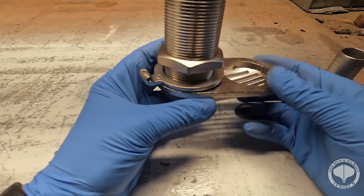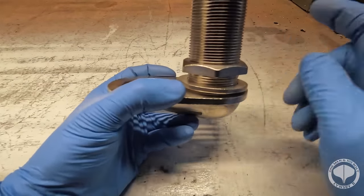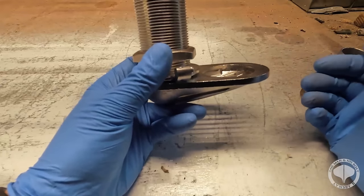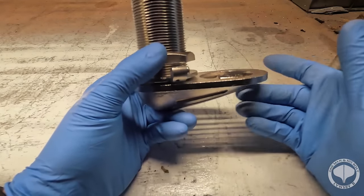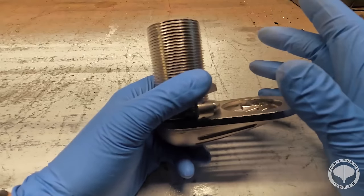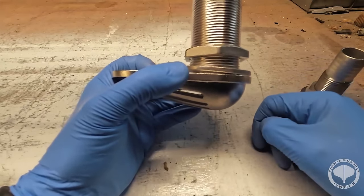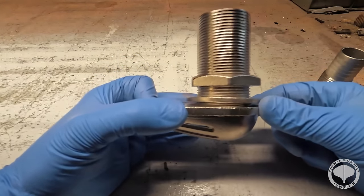Another top tip: when fitting a scoop, always fit it with the stem — the front of the vessel — to your right and the rear to your left. Because boats move forward 95% of the time, if you fit it the wrong way the force of water getting rammed into it will come through the top quicker, seals will break, and you could actually flood your boat — it has happened. Always make sure the bulbous bit is facing the front as best you can, depending on your type of boat.